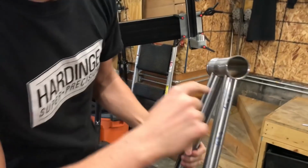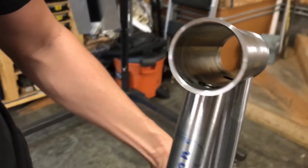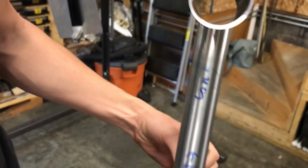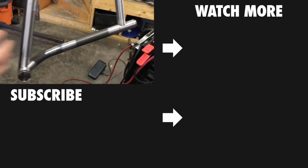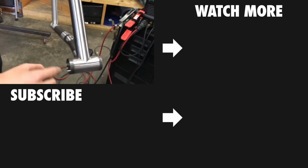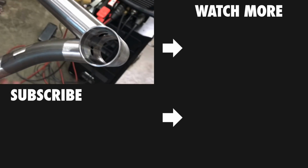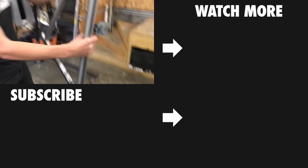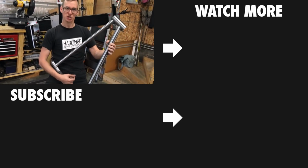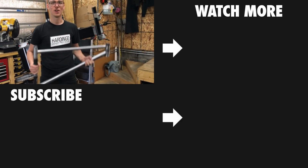It's kind of cool. You look inside of the tubes, you can see a little heat register mark from the different tacks, and those actually look pretty uniform. That's one way you can gauge how much heat you're putting into each zone, and the penetration that you get, if it looks consistent. Here you can see that longer stitch that we did. But anyway, it's turning into a thing. It's pretty cool. I'm stoked on it. And now we get to start welding it out.